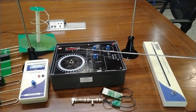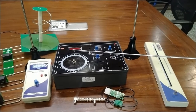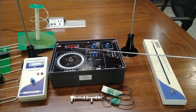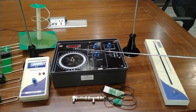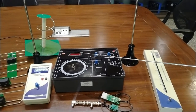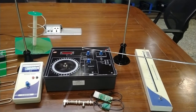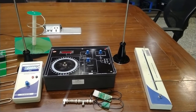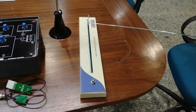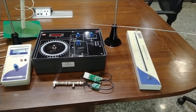The antenna rotation can be measured and scaled by the goniometer provided on the front panel, which can move the antenna from 0 to 360 degrees at 1-degree step regulation. The receiving antenna is a folded dipole type with a reflector, a digital meter, and 21 different types of antenna are provided with this complete setup. A slider-type matching stub is also provided, along with a digital meter for forward and reverse indication on the front panel LED screen.